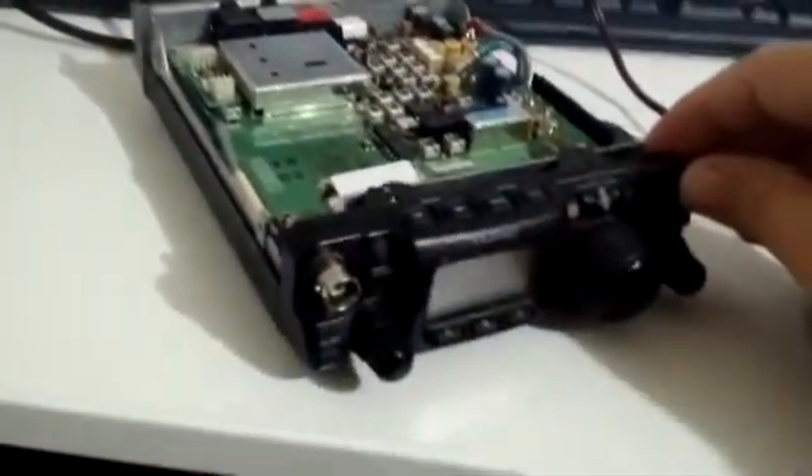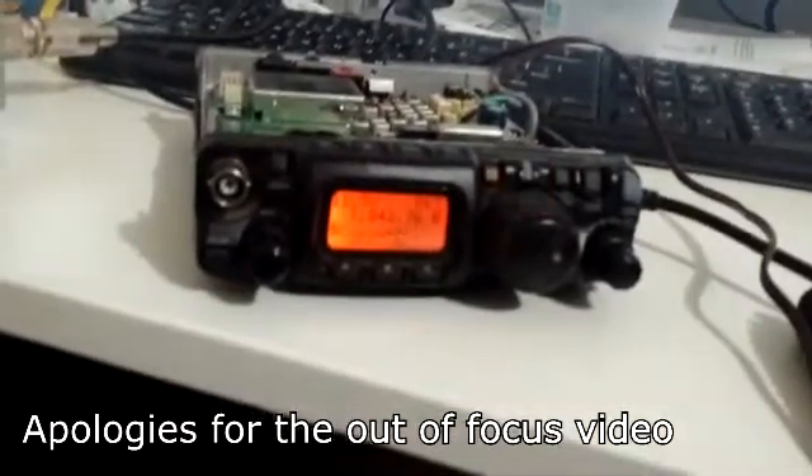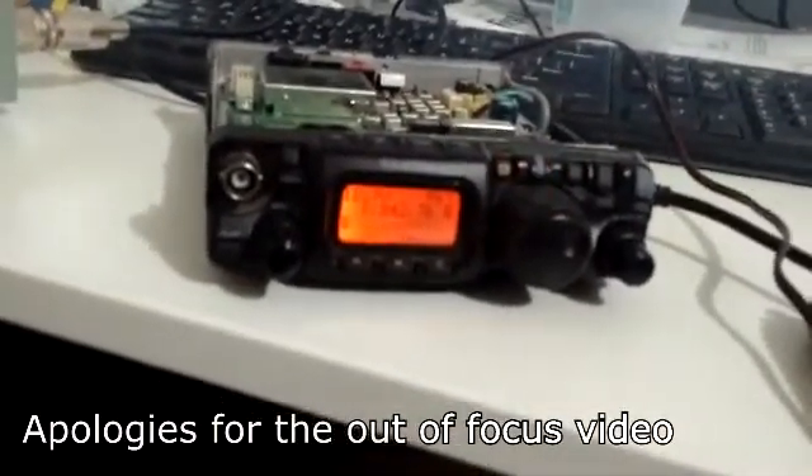Let's get the lid off — always fun trying to get it off with one hand — and there we go. As you can see, I already had the speaker unplugged because I tested this earlier and it worked, or failed. Anyway, let's get it on, and we'll stick with 160 meters. What happens when I press transmit is — if you have a good look — you'll see high SWR. I reckon that the problem, which was the problem before, was this little flat ribbon flex up the back here.